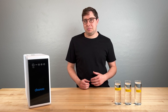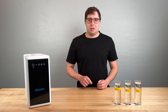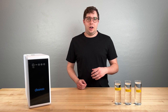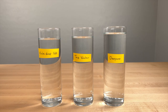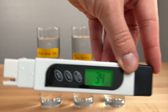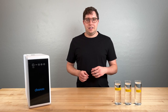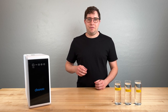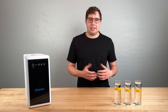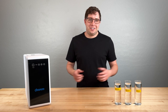That's extremely hard water because I live in the Arizona desert. Based on that figure, I'd expect these filters to be at 40 parts per million or below, since reverse osmosis filters remove 90% of TDS on average. The DePuro unit hits 19, which is really good, and the WaterDrop system is at 34, which is also really good. I have a theory that the DePuro unit performs a little better because it has a filter stage after the reverse osmosis membrane that the WaterDrop unit doesn't. But at the end of the day, those numbers are very similar and you're not likely to notice.